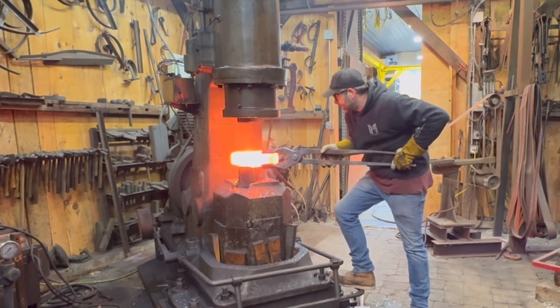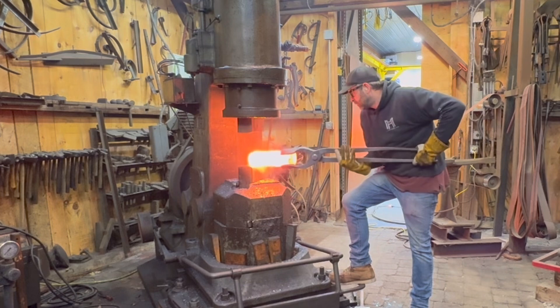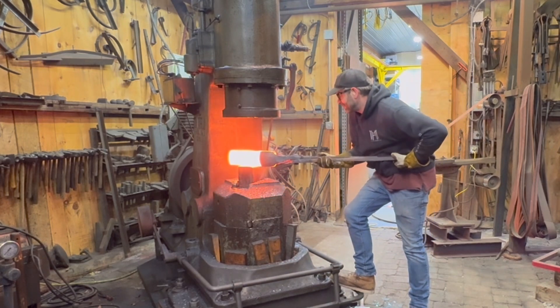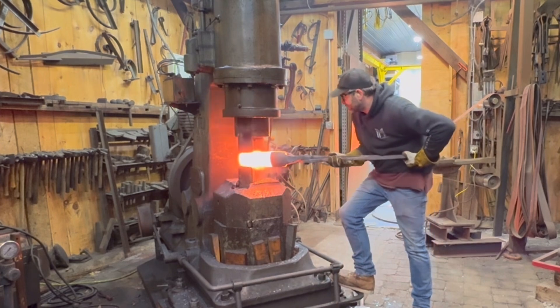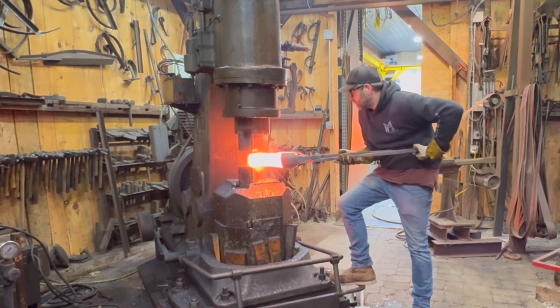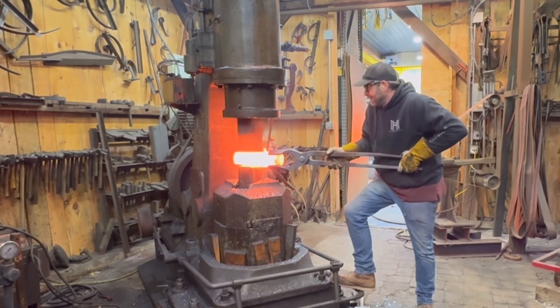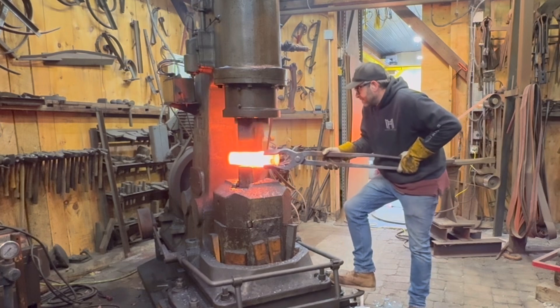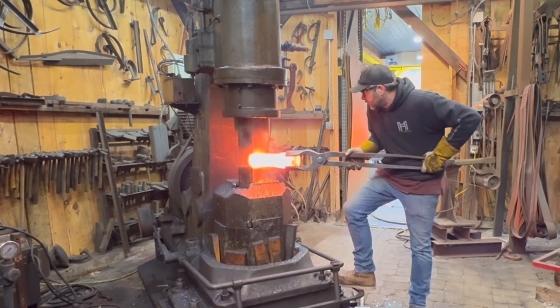A couple of keys with safety: you can see me working with the tongs on my side when I'm working huge billets like this. I never stand with the tongs directly in front of me, square to my gut, because I've heard stories in industrial shops where tongs literally got shot through a man and he died very quickly. So tongs on the side.